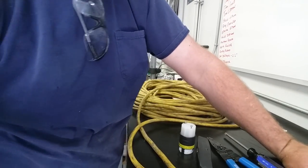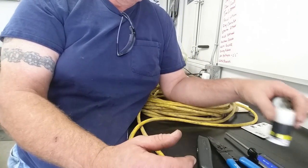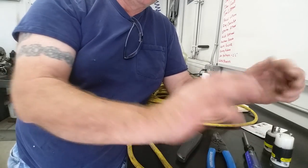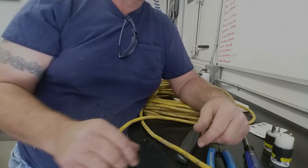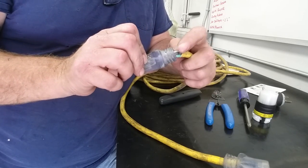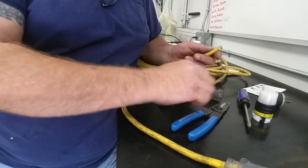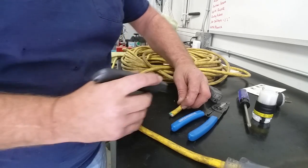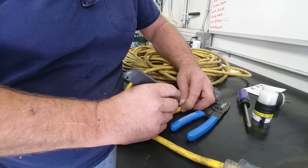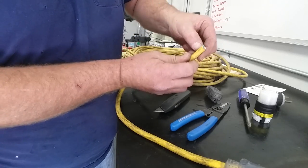Alright, let's get to wiring this thing. Cords are pretty easy — I know everyone has put an end on one of their cords at some point, but there are ways to go about it. You need three tools: a razor knife, a pair of strippers, and a number two Phillips — that's all you need. Let's start with the female end where we've got the bad insulation pulled away from the mold. We're just going to lob it off — see you later, that's done. We're going to take our razor knife and split about an inch or so of the outer insulation with a longitudinal cut.